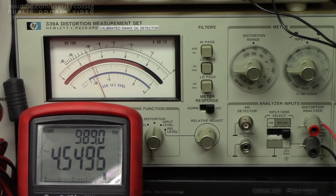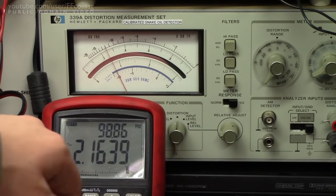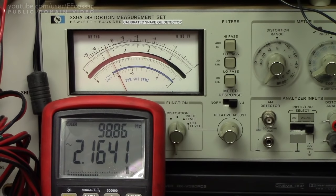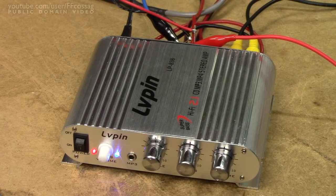Let's take it apart and have a look. As for the broken bass channel, at 100 Hz into 4 ohms it'll do about 1 watt at 1% distortion and about 2 watts at 10%. I went back to double-check my measurements, and now that the amplifier has warmed up, we're getting about 1 watt per channel on the left and right channels as well. So what we have here — being really generous — is a 2×1 watt plus 2 watt amplifier, a total output of about 4 watts combining all channels.